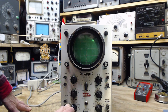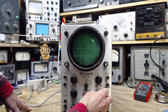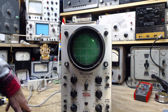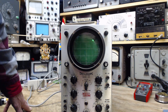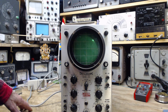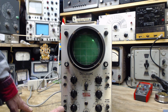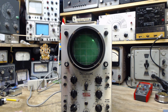Put the vertical gain halfway, phasing on zero, horizontal gain straight up, sweep vernier at 100 normally. Sync sweep — not sure about that — horizontal gain, horizontal selector. We'll put it on plus and leave it there. There's a calibrate setting right in the middle, then DC one way, AC the other. DC 100 volts — there won't be any signal going in at first. What we're hoping to get is just a trace across the screen.